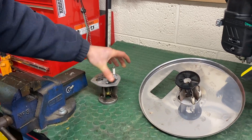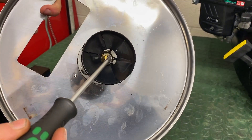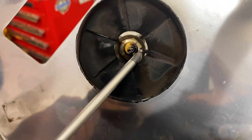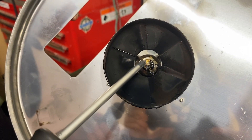If you have a quick look at this used assembly — this has done about 150 hours — you'll be able to see just on the tips of the electrodes they've lost the points. They've gone flat. This is usually where they need changing, and obviously the fuel nozzle has started to block up because it's not burning quite evenly.